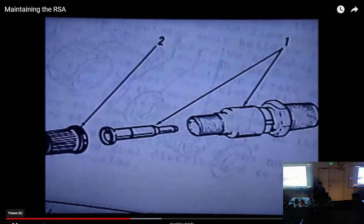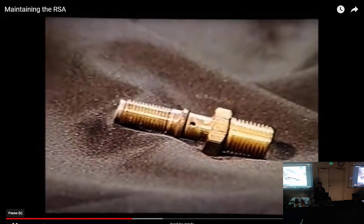Okay, he doesn't mean that these are interchangeable. He means the new, this two-piece one can go in an engine that has a one-piece right next to it, is what he means by they're interchangeable. But these two parts are matched. By the way, standard nozzles flow at 32 pounds per square inch. Now, there are assemblies referred to as high-flow nozzles.